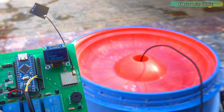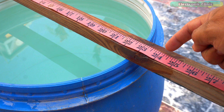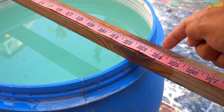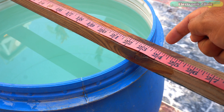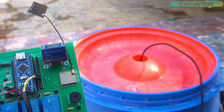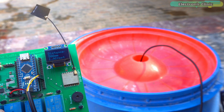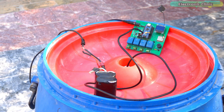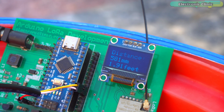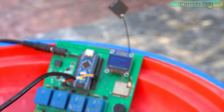The reading consistently shows 1.92 feet. When we verify this, subtracting the sensor length from the total measurement gives approximately 1.95 feet — very close to the measured distance. So far, this underwater ultrasonic sensor has performed exceptionally well: readings are consistent, accuracy is impressive, and depth measurements are highly reliable even with minor fluctuations. This level of precision makes it a great choice for robotics, marine research, and depth monitoring.